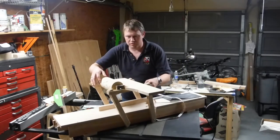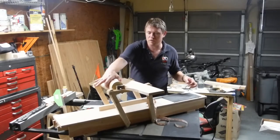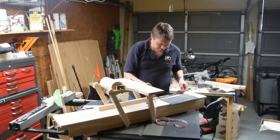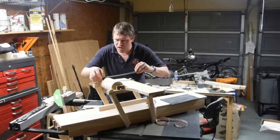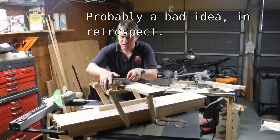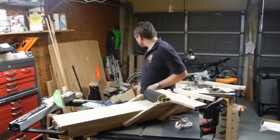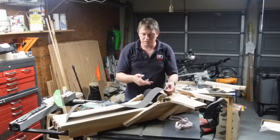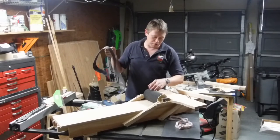So I got confident that this is nice and cylindrical. Measured the circumference, got an even measurement every time. That's pi times more accurate than trying to measure the diameter. I took some of this old liner — some sort of foam, normally used on the insides of drawers. The principle is the pad should provide just enough give. I bought this oversized sanding belt, which is much more than I need, but I couldn't get the size I really wanted. Now I just need to figure out what's the right parallelogram shape I need.